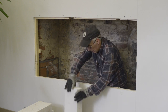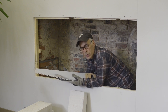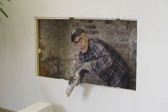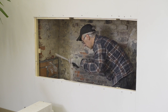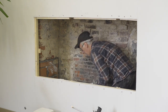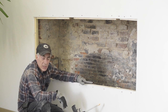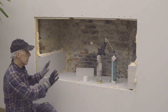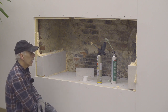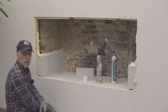There we go. This is a special saw blade for ytong — you can see the teeth are reinforced, so don't do it with a normal wood saw because it won't last very long. I always do them with this easy-fix adhesive, which works quite easily. I'll keep building up the ytong blocks until I reach the right level. So far so good — we filled up the bottom part with ytong blocks and now we're doing the sides. It's not strictly necessary but it's easier to finish it off, and then the opening is ready to receive the new fireplace.